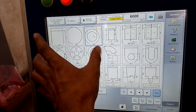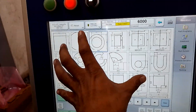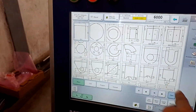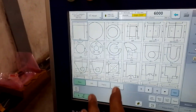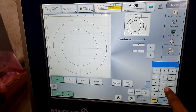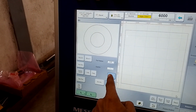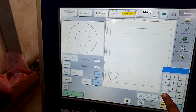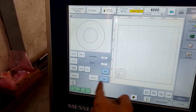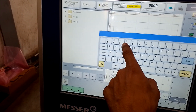I will explain — I will select the program, apply it, and here you can select presets. Preset means you have standard options, the same programs found in all kinds of CNC. These are basic programs and 90% of programs you can make with these. We want to cut straight. I will make this one whole because lead-in and lead-out will be explained here. I can give distance D — inner I will give 50 and outer 100. Then nest — single part. If I want all 20, I will add them. I want only one. Save it with any name — I will give it a simple name.